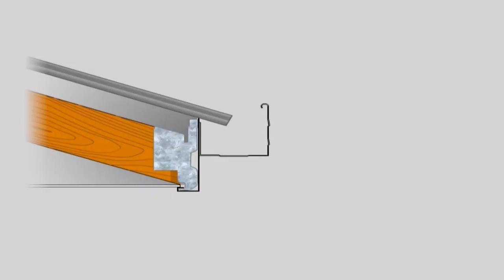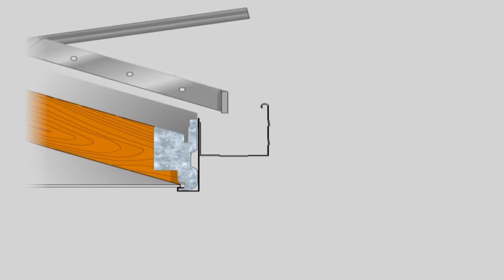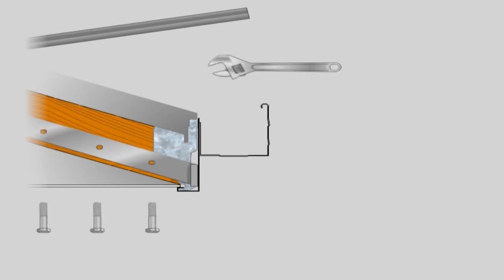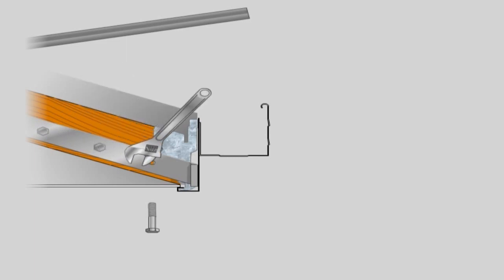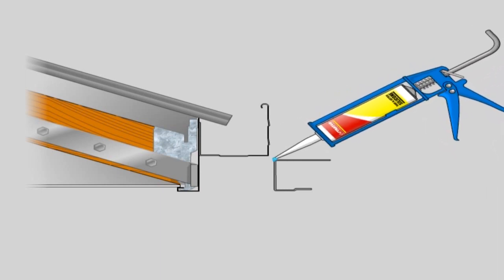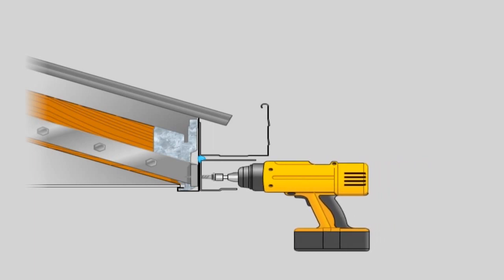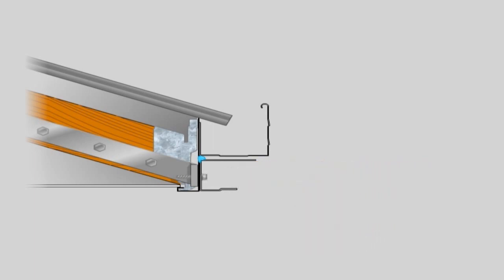Steel fascia attachment. When fixing the back channel to steel fascia, the roofing above each rafter must be removed to give adequate space to install the rafter strengthening brackets. M10 bolts connect the brackets to the rafter. It is the builder's responsibility to determine the adequacy of the fascia and rafters and the frequency of the brackets for each individual situation. Run a bead of silicone at the back of the back channel. Attach the back channel using 10x16mm hex head self-drilling screws through the fascia and bracket, then at 250mm centres. Insert the BIP foam into the back channel.